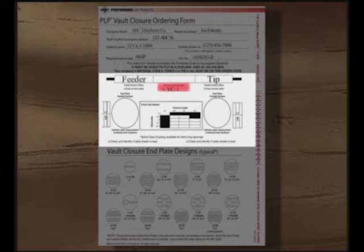If your company has an internal code number, PID number, or tone number, it will need to be listed in the space identified as closure identification. Next, place a mark in the area of the table which defines the diameter and length of closure for your application. For our example, we have selected the 9.5 by 28 inch closure.